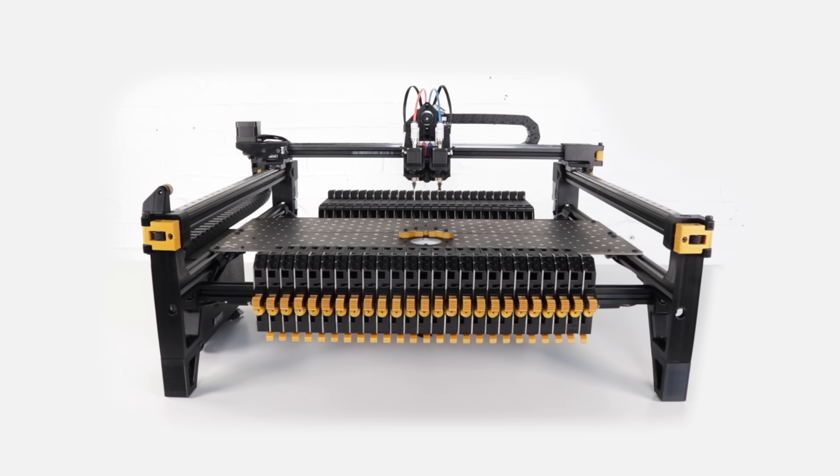there were so many little boards that I would have loved to just bang out on a fiber laser really quick to validate that the idea was going to be good, that my dimensions were accurate, and my wiring was sane and correct before we sent them out to a board shop — and that would have greatly de-risked so many things for me.